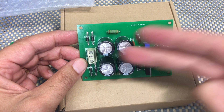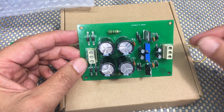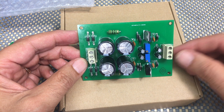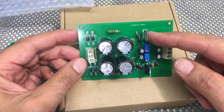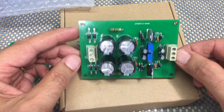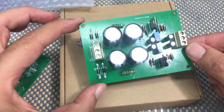As I mentioned, if I wanted just the positive supply I'd do away with the bottom section. Very seldom would you need the negative supply alone, but that's the reason I designed it like this. And if I wanted a fixed voltage regulator with the filtering in front, I'd do exactly the same except use a fixed 7805 or 7815 and do away with the variable adjust pins accordingly — just put a couple of shorts. But this board saves me a hell of a lot of time and the results are perfect.